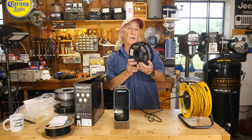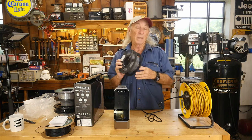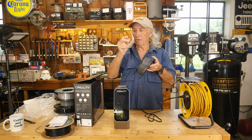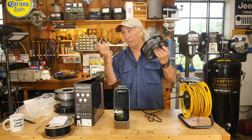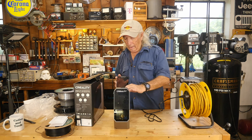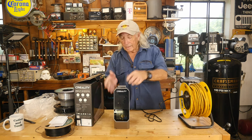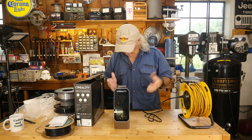Here's some no-brand plain old PLA gray. It's been laying around here forever, and in fact it's starting to get those little weird white specks, and pieces of it are just dropping off because the humidity is absolutely killing this thing. I'm in southern Texas, so the humidity here is horrendous. You can place the spool inside and it can easily carry the one kilogram spool — it fits in there easily with lots of space. I'm going to be feeding it through the top, but right now we're just going to dry it before we set it up.